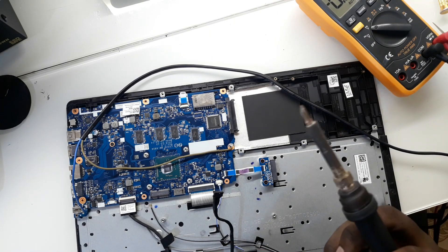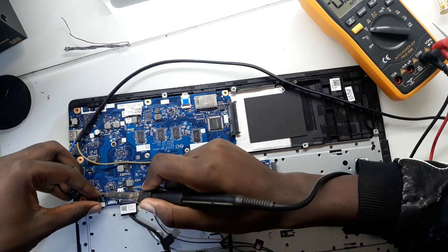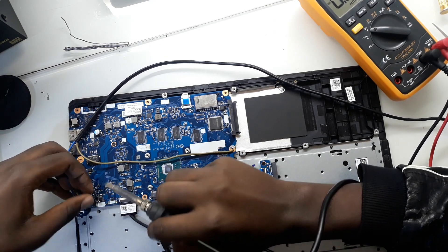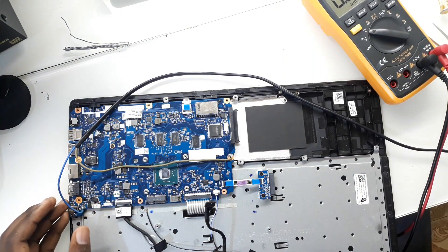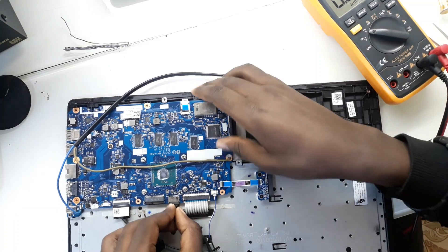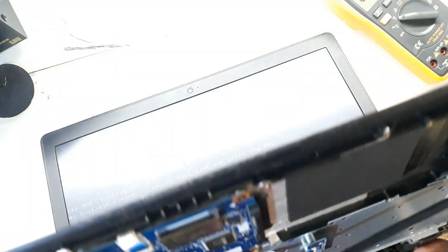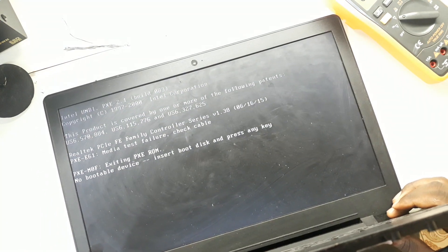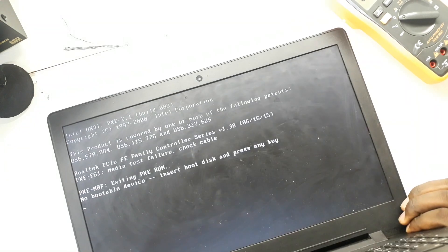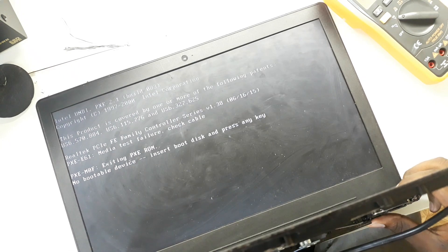Now I'm going to do some magic — I'm going to first make a loop. And yes, we have display on the screen. So the problem with this one was a false signal that was turning off the first MOSFET, and that's why it wasn't allowing volts to go through.